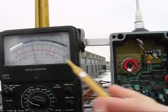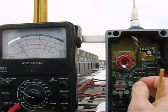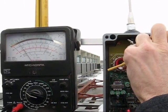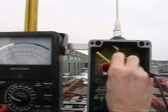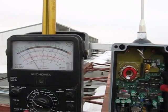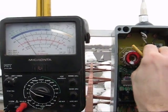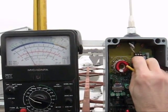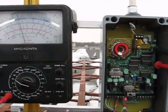Right here you can see we're at about 4 volts. What we're trying to do is use these jumpers — this coil tunes the antenna and the taps on the coil will give us varying readings. We're trying to get the maximum voltage. Starting here, we're at about 1.8 volts; moving to the next tap, still about 1.8 volts. It's about the same there. One and a half — went down. Still below 2 volts. That was about 2.2 volts.